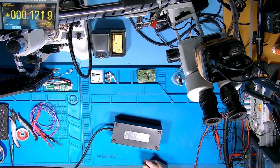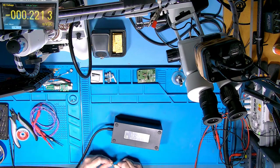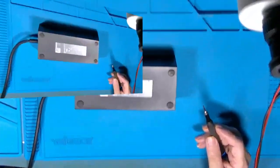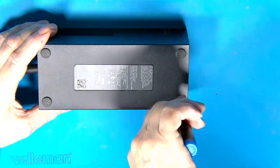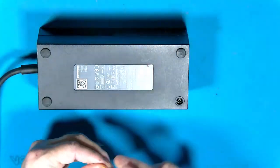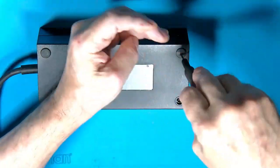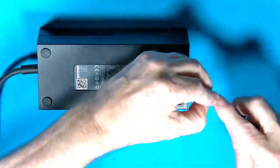The first thing we need to do is get these horrible little rubber feet out of the bottom. The easiest way I've found is to use just the hex torque driver — go down through the center of the foot and then gently pop it back, and it will come out. If you try and peel them off, chances are the foot will split and you'll end up with a flat bit with the other bit stuck inside.